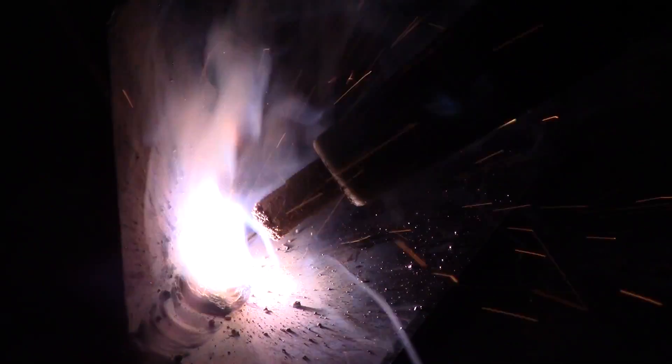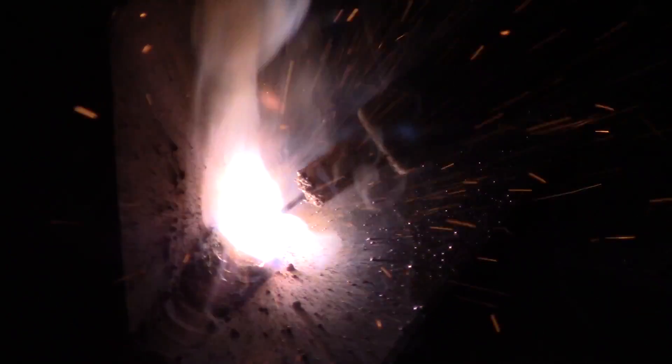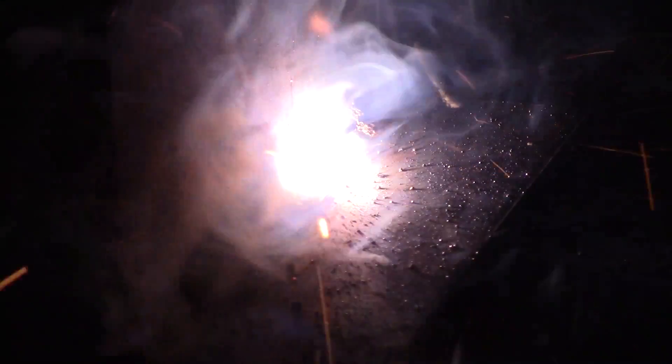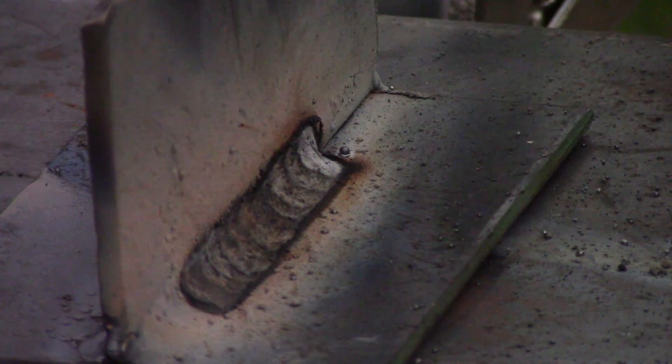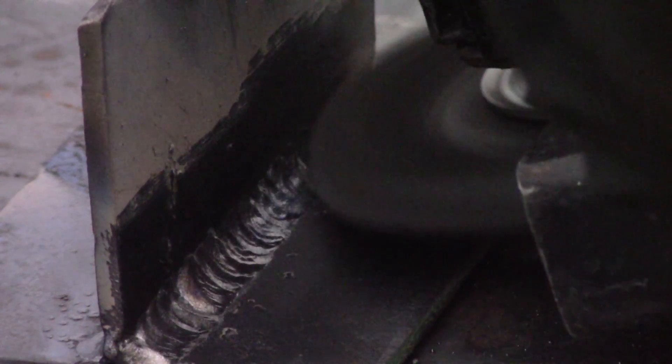Here's the stop and start. When doing your rod manipulation — which could be the cursive E, a C shape, zigzag up and down, or a back-and-forth whip — make sure you're not going too far ahead or doing too drastic a motion that causes you to trap slag in your weld. That will cause porosity, cracking, and weaknesses in your weld. So take it easy with the wire manipulation and don't go too drastic, or you could end up making your weld weaker when we're trying to make it stronger.